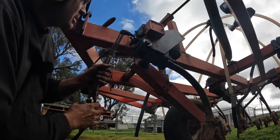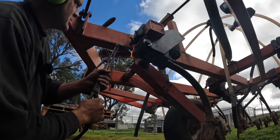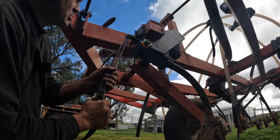The best thing to do is put some CRC on, and if they don't move, heat up this side and this side — pretty hot, red hot — and usually you can get them to move.